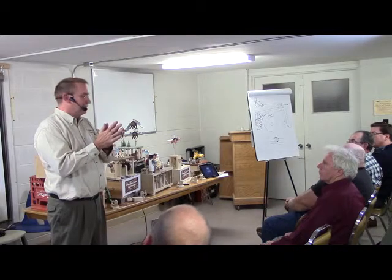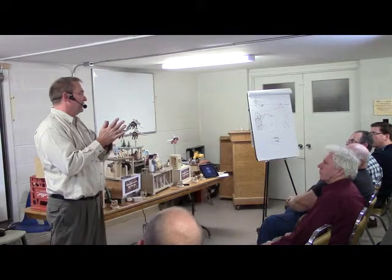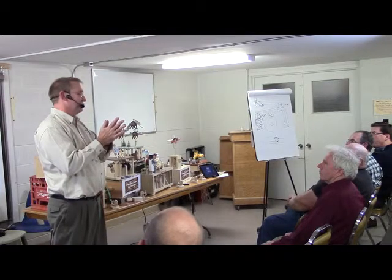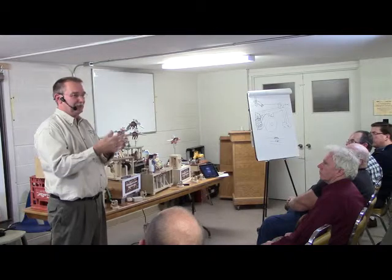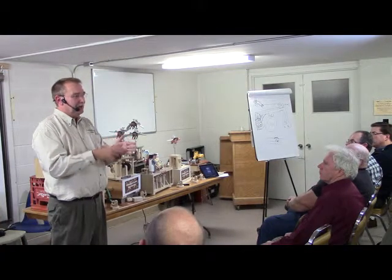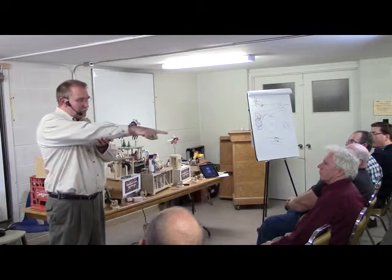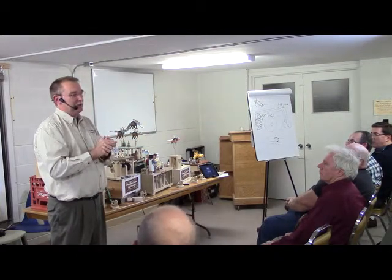Now, I did that because if I use the PVA glues, you know what? I've had them fail on me in the past, and there's nothing that chews you off more than having a cam in the middle of a long string come off. Because now you're, how do I fix it? Because it's got the residue from the other glue in there. Sometimes you have to try and drill a hole right through all the length of the cam into the middle, and put a pin in to keep it from rotating. So I use CA glue.